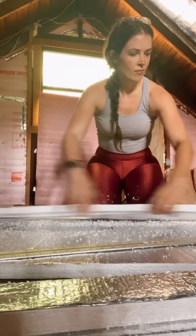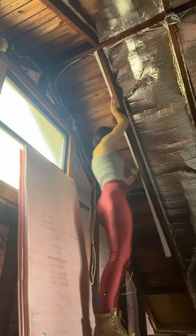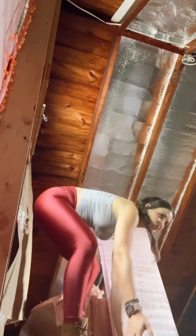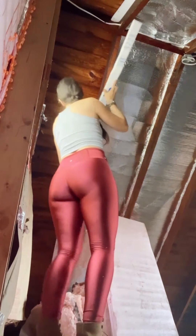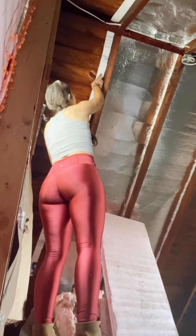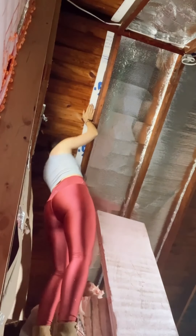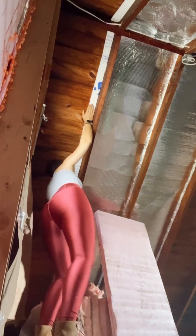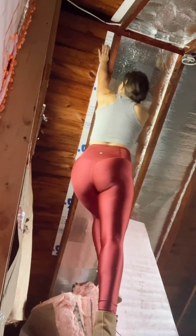Using these strips is a cheaper way to create an air channel at the back. With those cut, I'm attaching them to the roof — one on each side and one in the middle — using construction adhesive. This is going to allow air to flow from the base of the roof up to the point, aka the ridge vent. So I'm just gluing these pieces on into each section. You want to use construction adhesive here because if you use nails, it could shoot through your roof and out the top of your shingles, creating lots of holes.